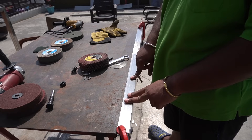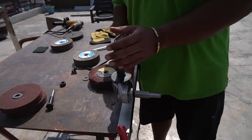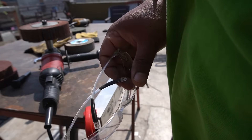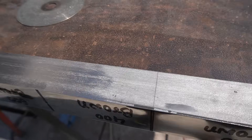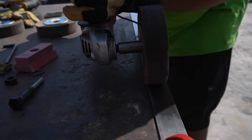The first thing I do is clamp the workpiece securely in place. I am working in sections — first I'm going to even out the entire surface, and the wheel I am using is 80 grit. Usually brush finish grit size lies between 80 to 320 grit. You can go higher than 320 but the scratch pattern is much smoother, which gives you a dull gloss finish rather than a matte finish. Always make sure to use eye protection while doing grinding work. Since the angle has mill scale, the removal of this layer took me around five to six minutes.